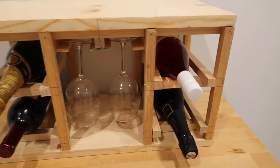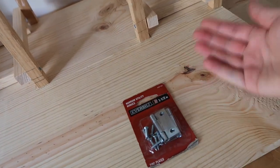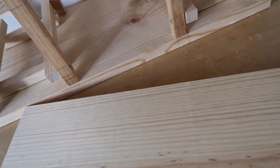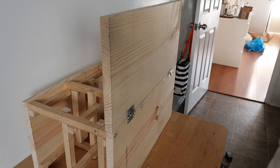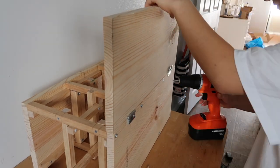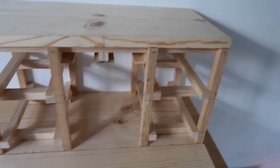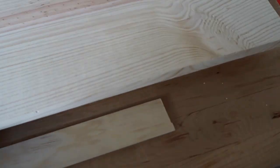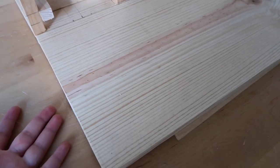This is it all together and I was so happy at this point. But here is my extra little part — I wanted it to have a section that opened up but folded over. Hinges are your best friend for this. I just attached the hinges between these two planks of wood so it's easy to store. A lot of wine racks and cheese boards just stick out, but how are you going to store that nicely? This way it folds. You can use it if you want — put cheeses and little things on top without even pulling it out at all. Because of the hinge there's a little dip, so I took a tiny scrap piece of wood and cut it to make a straight line, glued it underneath. It balances and levels it out, and also gives you a grip when picking up the board rather than from the ground.